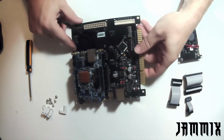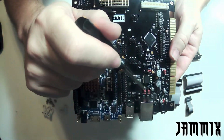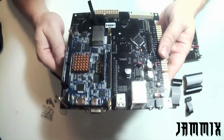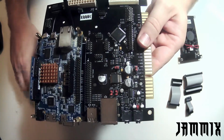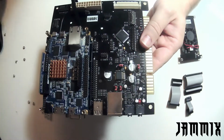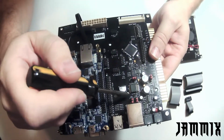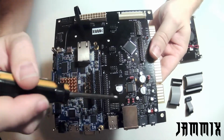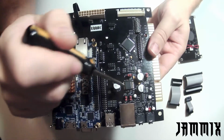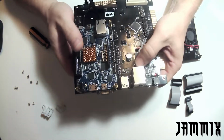The next thing we want to do is you have two jumpers here that are next to the USB Ethernet stack. So these two jumpers right here, there's a label that's res and there's a label that's I2S. And I'll see if I can show it to you. You can barely see it there, but you want to orientate everything so that the headers are towards the I2S side, and you kind of see that there. Here's res, and here's the I2S. So once those are set up, you're good to go.